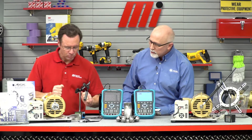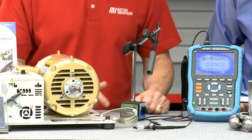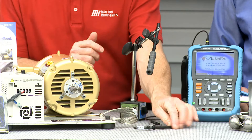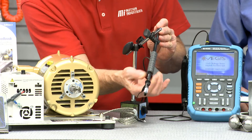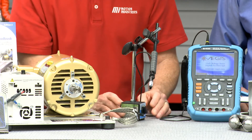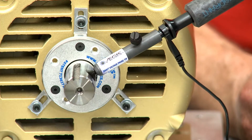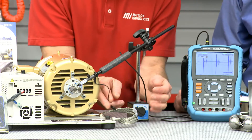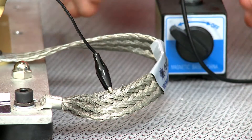Okay, how do I put this together? The first thing we're going to do is hit the green button on the scope to get it started — the universal symbol for turn me on. Now take the shaft voltage probe and stick it inside the holder in front of you, in the magnetic base holder. Position that holder so that the microfiber tip is touching the motor's shaft. Then the last thing you do is connect the ground lead to the Aegis high-frequency ground strap that's grounding the frame of the motor to ground.